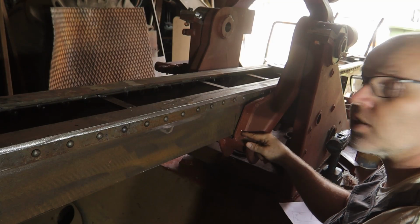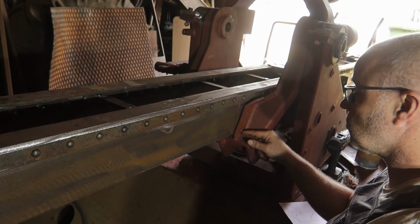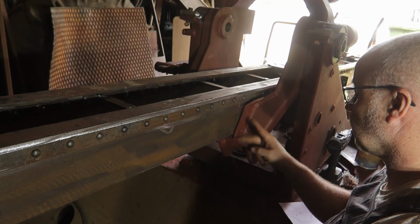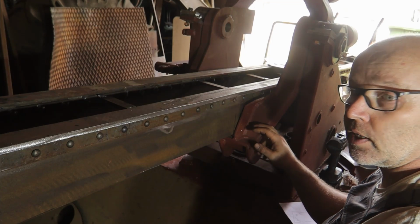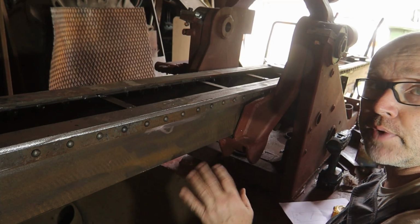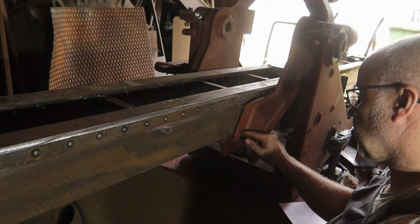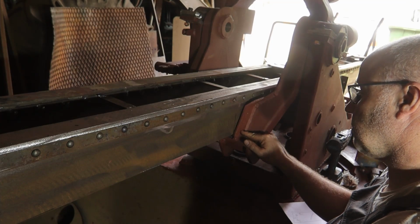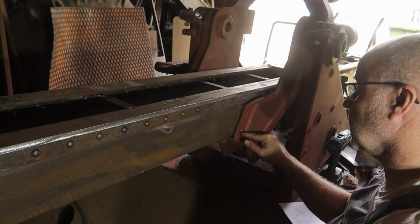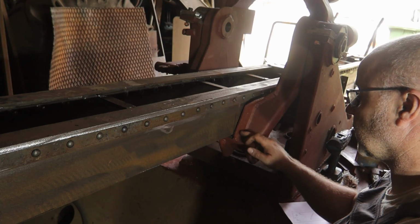For these holes, it's what I said, a bolt connection, not a rivet, and it also has a crown nut on the outside. But for now I will put normal M10 bolts in. I don't have the crown nuts here right now, neither the bolts with the holes. So yeah, we can still arrange it later when we have everything put together. If you put normal bolts in it, because getting the right bolts with a hole in it is probably going to be impossible, and then put the crown nut on it and drill through at the correct position.